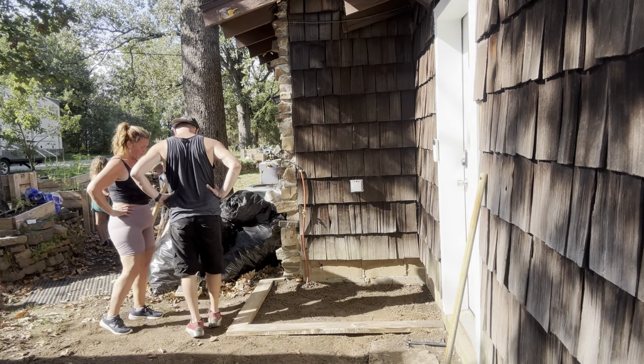So what she's talking about here is, if you watch the Cajun Country Living videos, they dig down a foot so that the water doesn't wash underneath it and erode the bottom of the concrete. But the plan here is to eventually continue on. So when you get to the last slab, you'd want to bury that so that it's flush with the ground, right? You would do that by taking some material out, and the only way to do that here would be to scrape it down the 1.5 inches and then get it flush with the ground. But it's already low here, so that wouldn't really be the best solution for us, in my opinion. So I'm going to try something a little different here, but that's the plan.